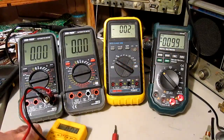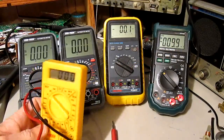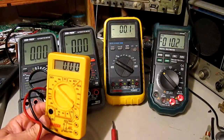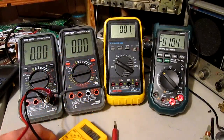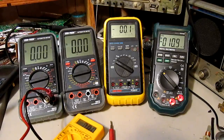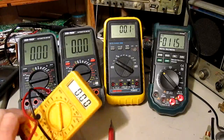I also got one of these really cheapo meters. You know what you use this meter for? This is a meter you use when you're not sure about what you're measuring and you don't care if you fry it. I fried one of those. I have a transformer — measures about 10 by 12 by 10 inches, 5,000 volts through a voltage divider. I didn't think about the accumulation of gaps across it, not just the gaps across the two points where the voltage goes into the board. It arced, meter went bye-bye. So when you're not sure, use a cheap one.